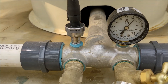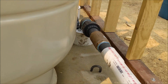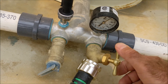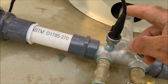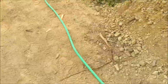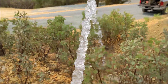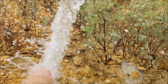Let's give it a try. See the pressure inside the pressure tank right there. Going back down to the booster tank — let's turn this hose on and see if we got some water and any leaks. Oh, it sounds good. This right here is a pressure sensor going back to the panel. That's what I call water pressure and flow — look at that. That might be 15 gallons per minute. It's a small little hose but it's putting out a lot of water.